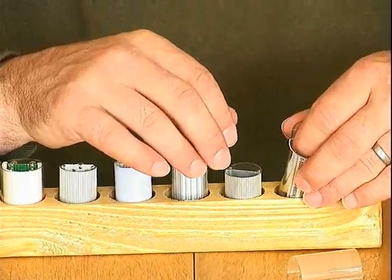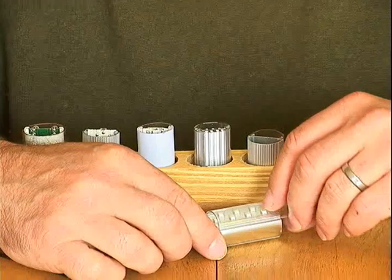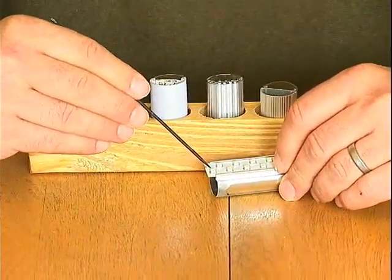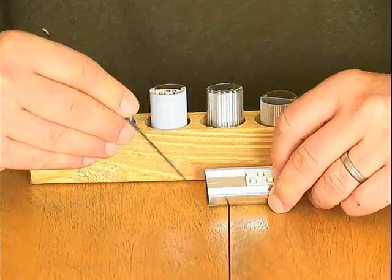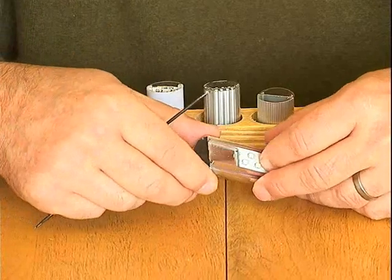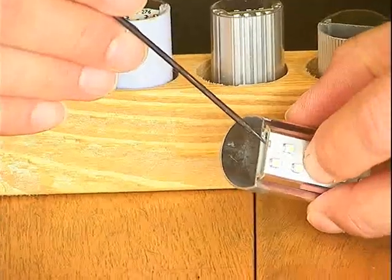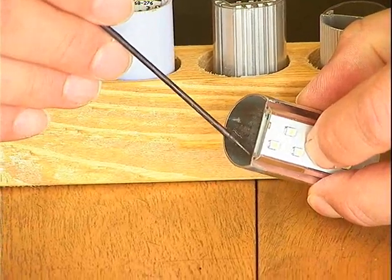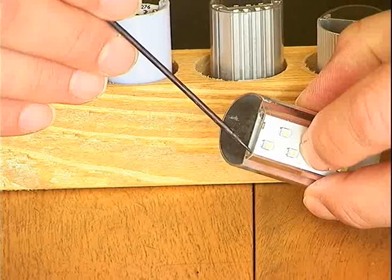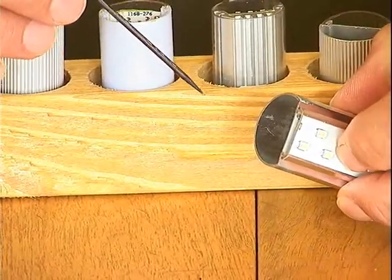Going on to the next one on the list, and you see it kind of falls apart when I take it out. Once again, they use the surface mount diodes. They use an aluminum shell that comes all the way across the back, but they make an interesting design choice here in that the circuit card is mounted in 2 little ribs and it's separated by about 1/16 of an inch air gap between the aluminum, thus making it very difficult for any heat to get out of that.